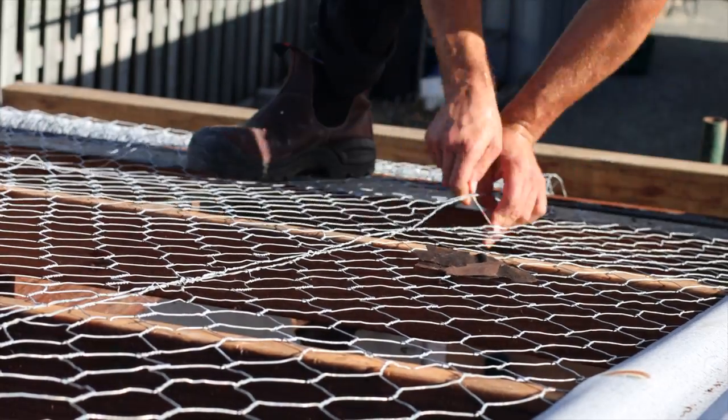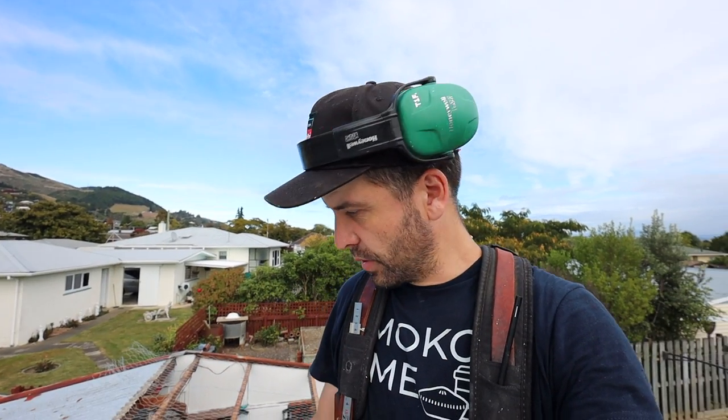A lot of people said in the last video that you should put your building underlay horizontal — the opposite direction of the roofing iron — not vertical the way I've done it. I agree, that is better. As people pointed out, if the roof leaks it'll hit the underlay and run down rather than potentially going under the lap and in. But the reason I made this choice is it's a lot easier — I'm taking up sheets one at a time and can put underlay down one strip at a time. If I went across the way, I'd have to take the whole roof side off and go end to end. If there were a bunch of us working on this together we could do that, but this is my house and I'm working on it by myself.